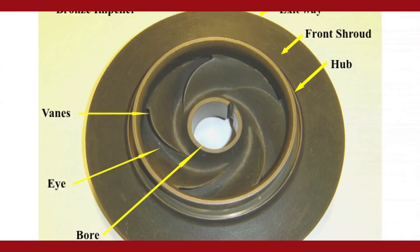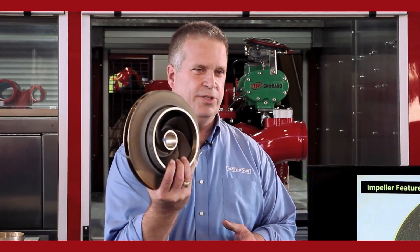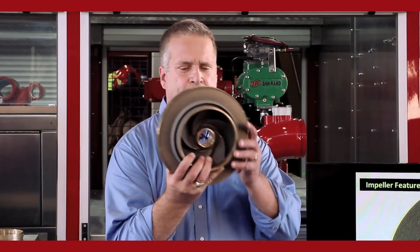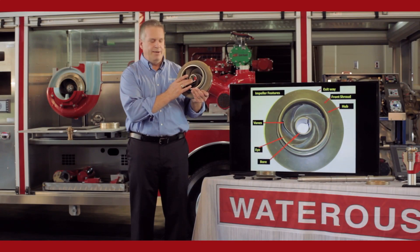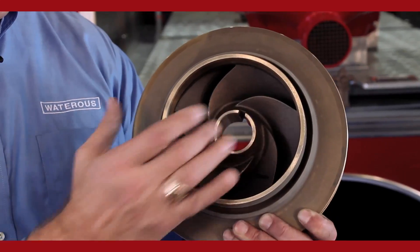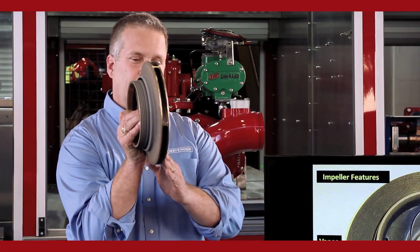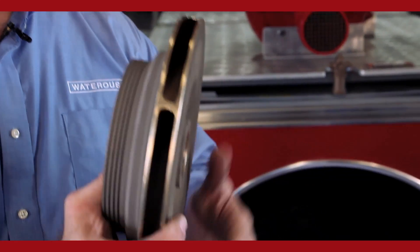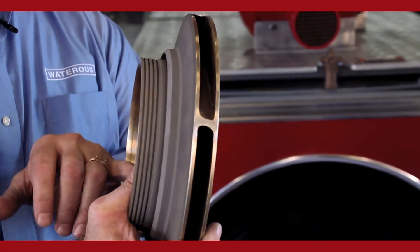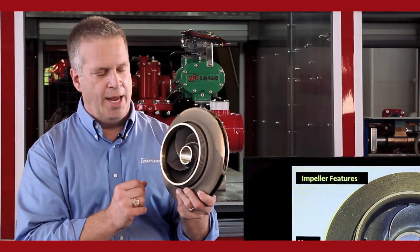Basic components: the bronze impeller, that's standard in the fire service — resistance to heat, resistance to corrosion. The basic parts of this impeller: the very center is the bore, it's pressed onto the impeller shaft. There's a keyway cut into it, so it's keyed on. We're going to trap the impeller shaft and the impeller axially, so we use a C-ring or retaining ring on the backside of the impeller, and a lock ring, nut, or snap ring on the front side depending on the design.